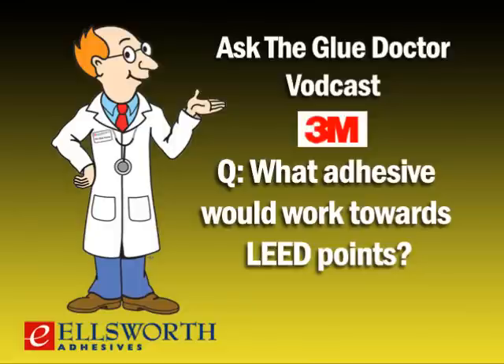You mentioned LEED — what adhesive would work towards LEED points? We have several. Fast Bond 30 is an adhesive that's been around for 40 years in bulk form, now available in the cylinder system. Our General Purpose 60 CA also meets LEED criteria — it's a low-VOC, very sticky, extremely high-solids product that also meets the stringent requirements of the Southern California Rule 1168 district. Another unique product is our Scotch-Weld Post Forming 94 CA adhesive, which has only 79 grams per liter VOCs, meeting California requirements as well as OTC rulings coming into effect in the Northeast.